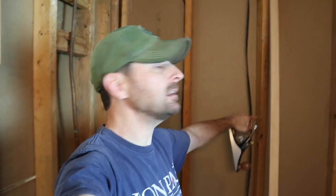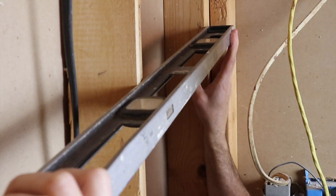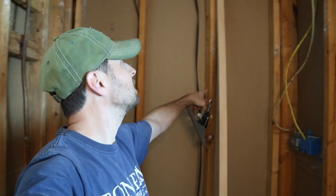We've got our subfloor replaced. Our next move is to straighten out our walls to receive the DenShield wallboard so we can have a perfectly dead flat surface for our tile. To make our walls nice and flat, we're going to use an old hand plane and plane down the studs that are too high. My level was rocking back and forth on one stud in particular, probably because it's twisted and the corner is sticking out proud of the wall, so we're going to hand plane that corner down.